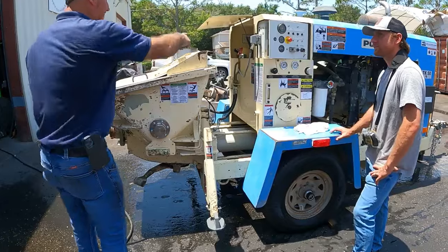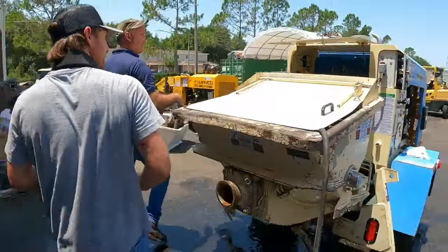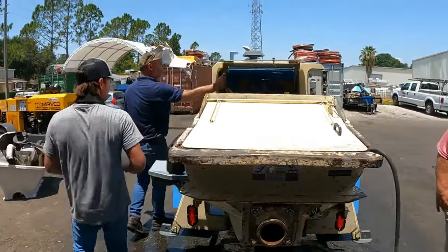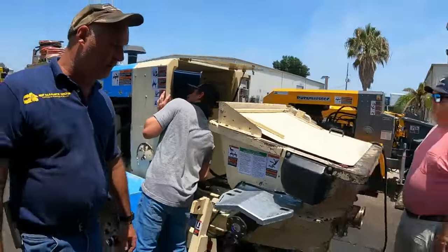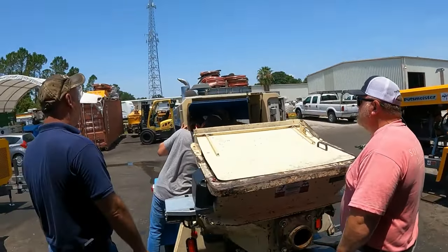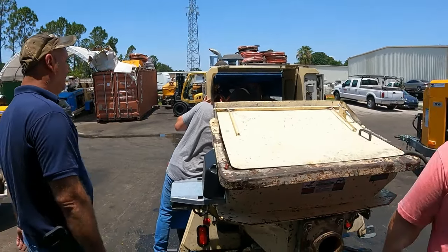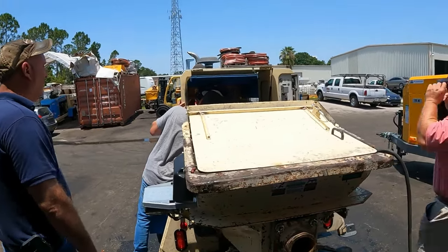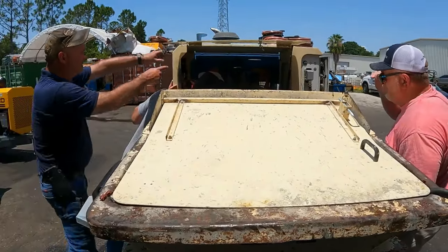So that K230 is leading to the switchover for the reversing valve, and that's in here. If you look at the placard here, it shows you what they do. The closest one to you is for the S-tube, right and left, and the furthest one is for your differential cylinders.